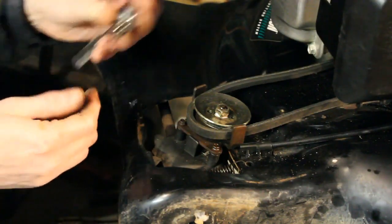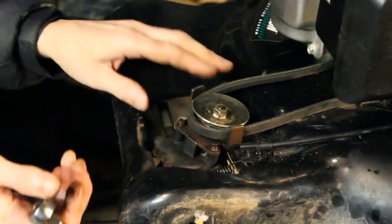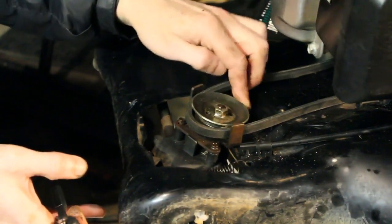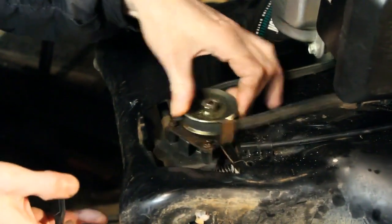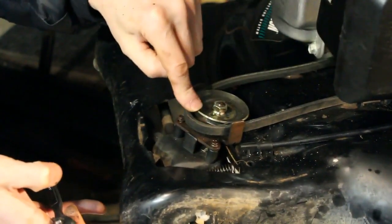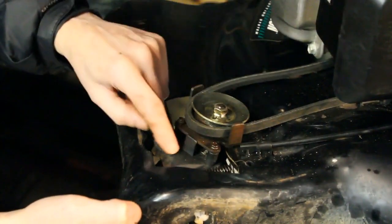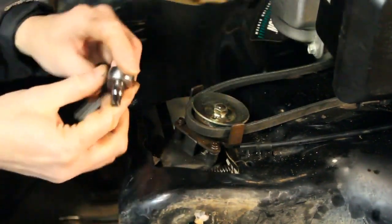I'm going to remove this pulley with a quarter-inch socket. How this system works: there's a pulley on the shaft below the motor. The belt sits there, and when you pull the cable it pulls this gear forward, bringing the belt into contact with this pulley and turning the wheels through this gearbox. It's not turning anything here - I suspect there's an issue with the worm gear or some gear inside, but we're going to open it up.